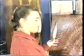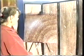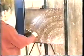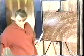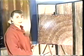And what you would do is, if you had four raised panel doors on a piece of furniture, on a hutch or whatever, you would start all of your feathering from the middle, and you would go out this way on this one, out that way on that one, down that way on that one, and down that way on that one. And that can be a really neat effect. And again, don't be afraid to make a mistake, because you can just go in there and go over it. And no one will ever know.